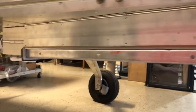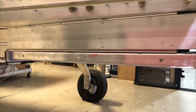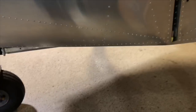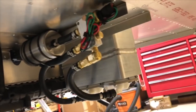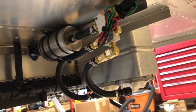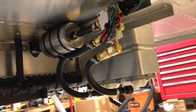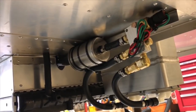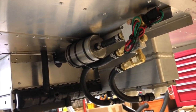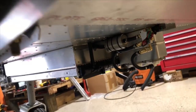You have to get some three-inch scrap aluminum or something from McMaster-Carr just to make a box. You can get something to hold the air from leaking out from the radiator. Being a low-wing airplane, we decided on this installation, which turned out nice. Since we have a radiator here anyway, we put our little sump tank behind the radiator on the belly. Then all the fuel is out of the cabin, and we've got gravity feed from both wings right there. And if you ever had to work on it, you wouldn't get anything inside the plane — no smell or anything like that. So those are the components.